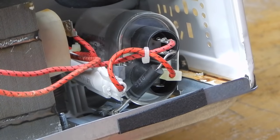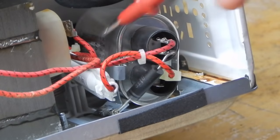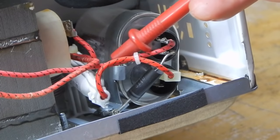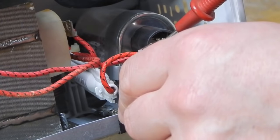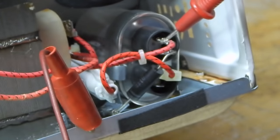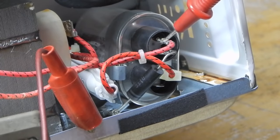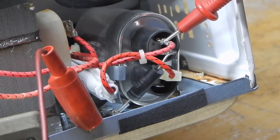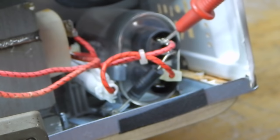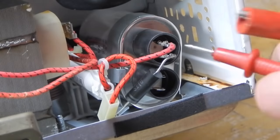It's funny - I didn't even notice it when I was first looking at this, but the diode's right here. I'm not sure what this white package is, zip-tied in place - what if there's another fuse in there? Anyway, this is my diode, and the diode goes from here down to a ground screw that grounds it to the chassis. If I go right across here I can actually see my reading on my meter is not a dead short across the diode - it's actually acting like that capacitor is charging, which is interesting.